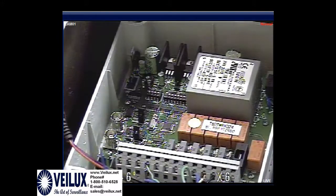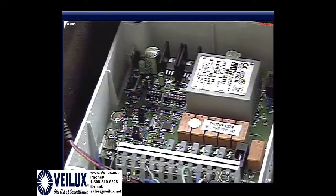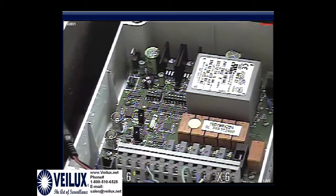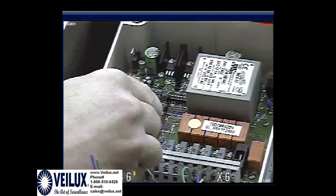You've got a set of switches up here. This is for the protocols and commands at this unit. They're automatically set up for our unit as 2400 baud rate, Pelco D, so you want to be sure port 3 is up. The IDs are listed right here beside it.